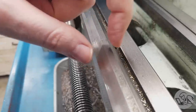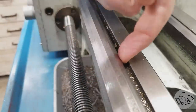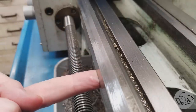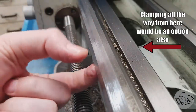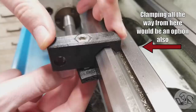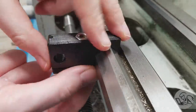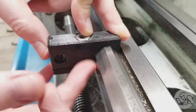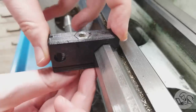Fitting something to these ways turns out to be a more interesting problem than you'd expect. There's no way to clamp across this way — there's no meat here opposed to this surface — and the underside surface isn't deep enough to get an opposing clamp from the top. We're forced to clamp from this surface to one of these angles, and it's not entirely clear how that works. With the plastic one, the clamping forces were mostly just deforming the material — it wasn't exactly clear where they were being applied. Making this in aluminum revealed exactly where the clamping surfaces end up being.